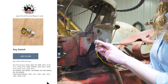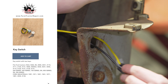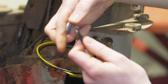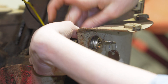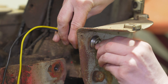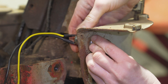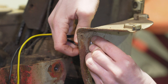I am choosing to put a key switch into the tractor. I prefer a key switch over an on-off toggle switch just for safety reasons, so that nobody who shouldn't be starting the tractor is starting it. Behind the switch there's just a washer and a simple nut. It feeds around on the back side, and on the side of the switch there are some flat spots that will help you get it in position. Then I'll just tighten this down and the switch will be ready to go.